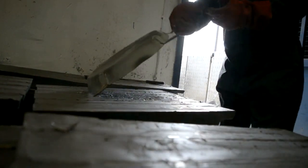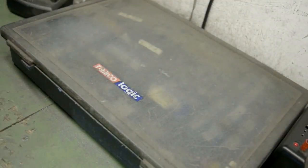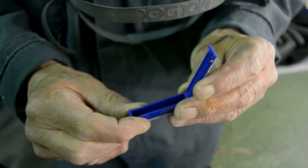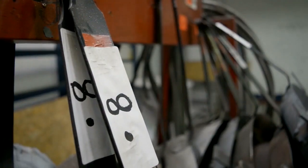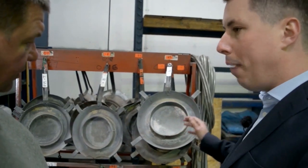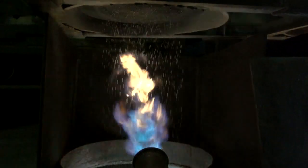These are what you can describe as industrial frying pans. We use a micro drill to drill the holes in the pan — you can see 0.9, 0.85, 0.8 — which each equate to a different size of shot. We tap the molten lead out into the pan and as it goes down the tower it forms into your lead ball — your shot. We re-drill the pans every day, though the pan itself lasts quite a long time. Every shift we re-drill the holes to guarantee the actual hole diameter, just to make sure that every piece of shot is falling true to size.